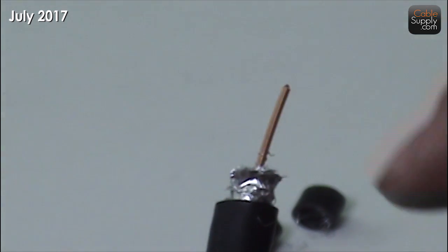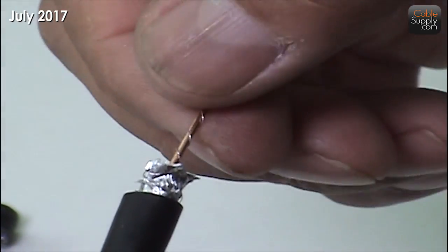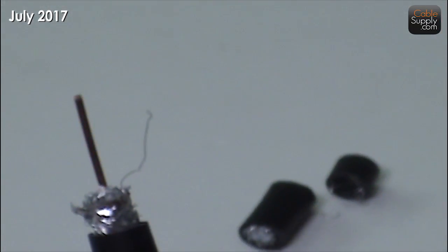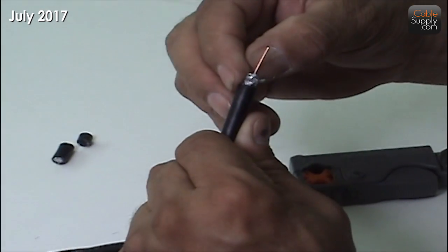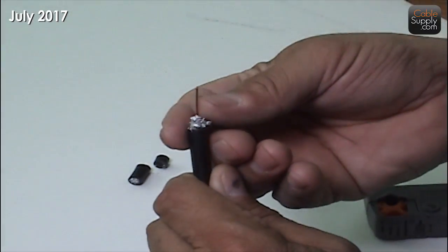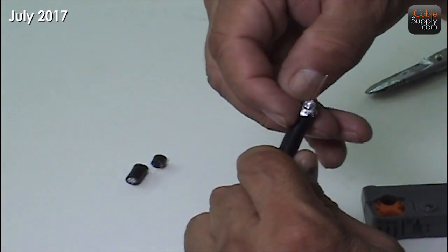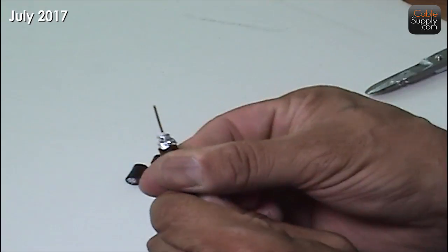You've got to watch it — that's the foil. You can see the foil right there, and you see how that cable twisted around there — that would short it out. Of course, all you need to do when you're all done is just do a continuity test; that's the only test. You want to make sure that the center wire from one end to the other goes through, and you want to make sure that there's no shorts between the outside shielding, which is pretty much grounded, and the inside wire — it's copper.